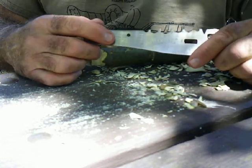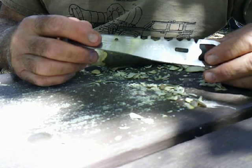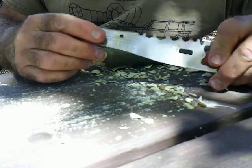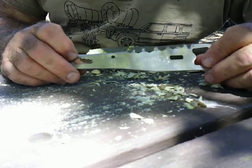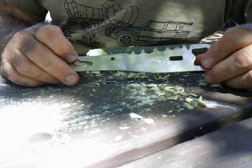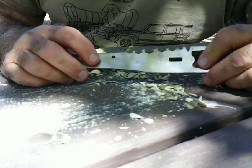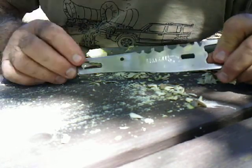And this is a clinometer. This is for calculating the height of a mountain. It was shown on the information card of the product as a rangefinder. I asked around and could find nothing that indicated how to calculate range with this. But what you can do is figure out the height of a tree or a mountain if you know the distance to the base, shoot the angle with the degrees on here, and use mathematical formulas to calculate the height.